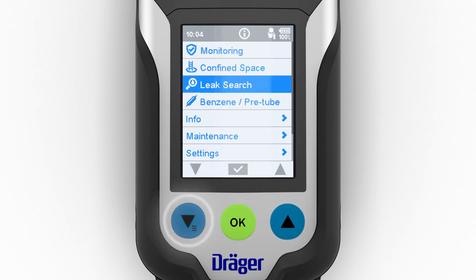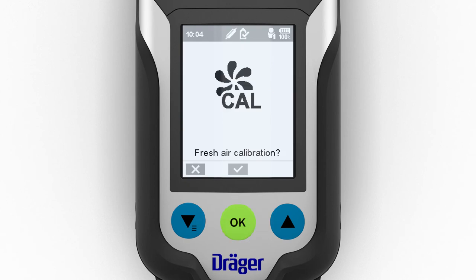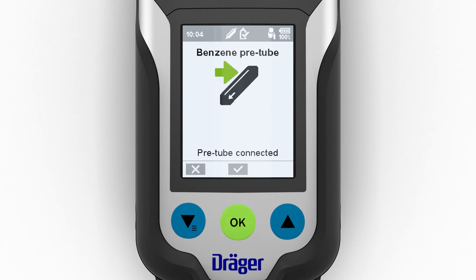And select the benzene pre-tube option. You will then see a dialog for the fresh air calibration. Carry out this step using a carbon pre-tube or skip the step by left-clicking on X. During this process, the carbon pre-tube will remove any existing hydrocarbons. Follow the prompts given by the wizard.